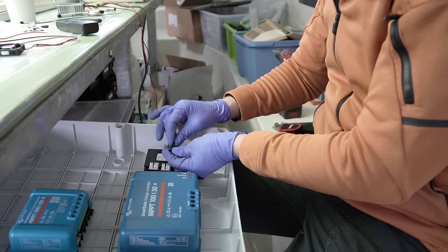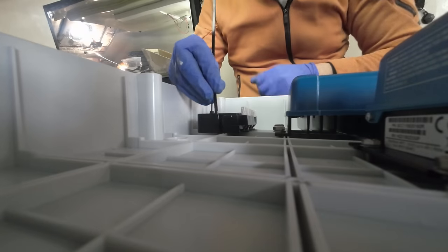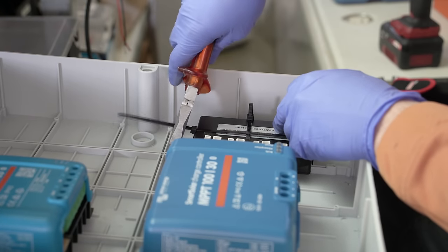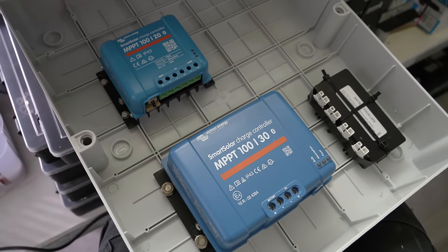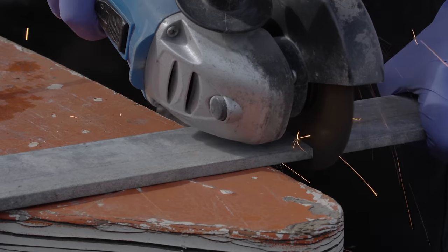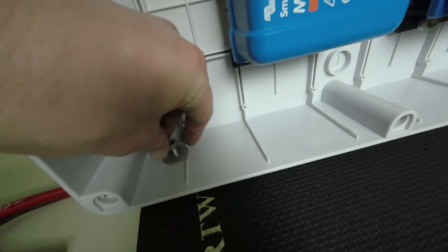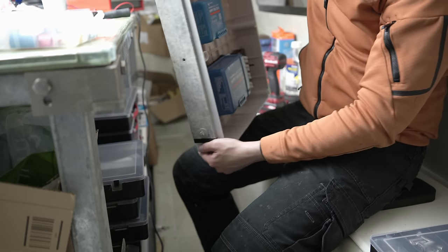Also in here will be space for a battery balancer — a lot more on that in an upcoming episode — plus a wind charge controller, and a handful of accessories. Most can be bolted straight to the robust plastic enclosure, but one has such tiny mounting holes that I've opted for cable ties. I'm going to mount the box vertically on a side hinge so it can be folded out of the way, and for that it needs a rigid brace, otherwise a few kilos of mounted contents will start to contort the plastic. Never one to be accused of over-engineering, I've sought the assistance of my large pile of not-yet-installed ballast steel. With the ends primed and dip coated — we don't want rust stains in future years — and some carefully located, then relocated, bolts when I realised I'd clashed with some of the internals of the enclosure's moulding, it all came together as planned.